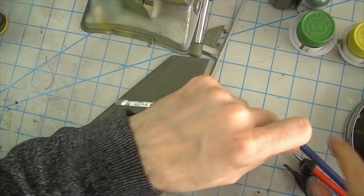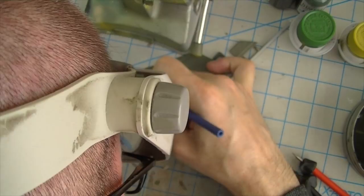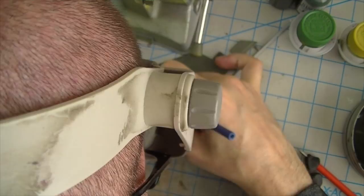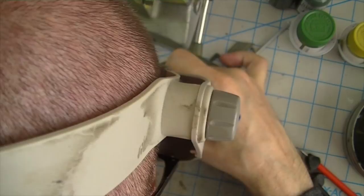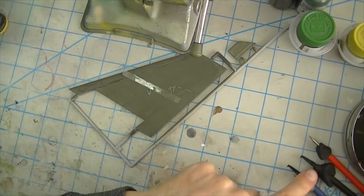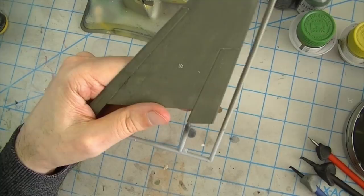And since I've got that Dymo tape on there, and I kind of would like to compare the width of the narrow versus the wide, I'm going to cut another one here with the wider one. Oops, slipped a little bit. Got out of my channel. See if we can do a better job over here. That's the thing. If your scribing tool slips once, you really have to stop and evaluate what's going on because it's tough to straighten that line back out if you don't work at it. If you just keep scribing without trying to correct it, you're just going to have a crooked line, and that's no good. Now, see, Dymo, or not Dymo, Hi-Q comes right off of there.